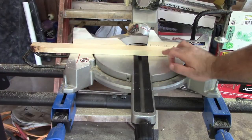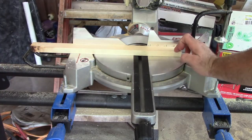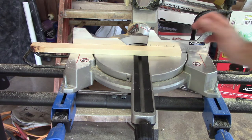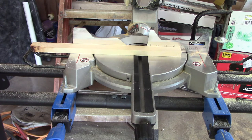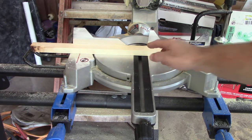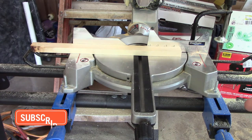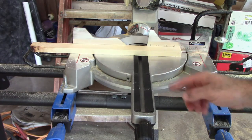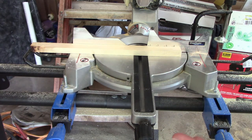So I've got another piece here that's three quarters of an inch by one and a half inches. We're going to be using this piece as basically a border around our base piece, which is going to keep our seed from falling off onto the ground. We're going to cut a five-inch piece off of this, then measure our two sides and cut them down as well. We're going to put a 45-degree bevel on each of these to make sure it lines up right — it'll kind of resemble a picture frame.